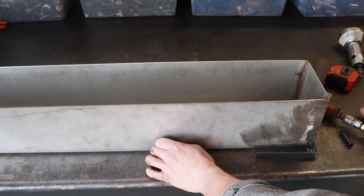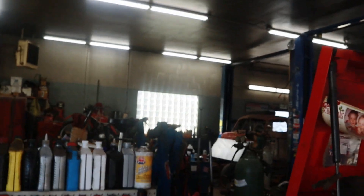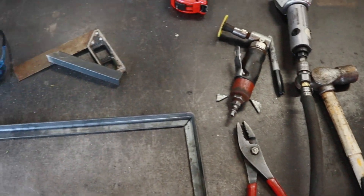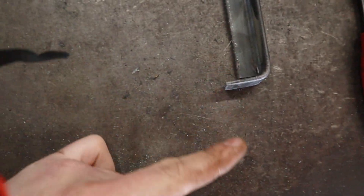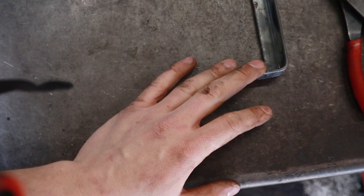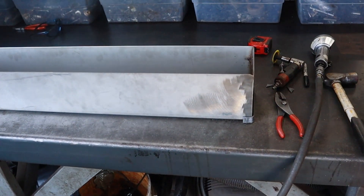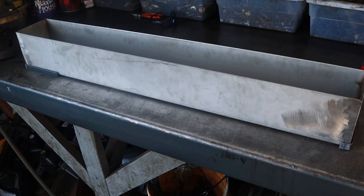That's way off — I caught it on camera. I may have messed up my measurement a little bit. It's kind of difficult to record. But that's okay — if stuff like that happens, you just have to keep on moving. I under-measured this side ever so slightly. What I ended up doing was I cut it off where I had originally cut it and bent it, lopped off the bottom side, and put a new bend in where it was supposed to go so my new piece of angle iron will run over and meet up flush. It's going to be just fine. The last part is nice and snug — it's going to hold it up. I've got one more piece to cut and measure, and then we'll start welding.